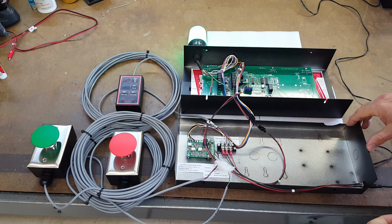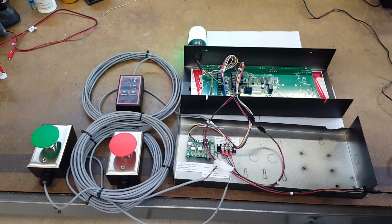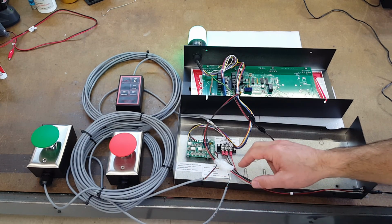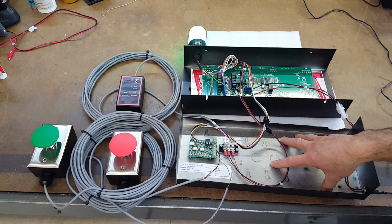And then we have a power. Our power is a 2.1 millimeter 6-foot cord, 24-volt power supply, 1 amp. It takes 120 volts AC. There's labeling inside to indicate what goes where with your wiring, to give you some kind of quick field reference.